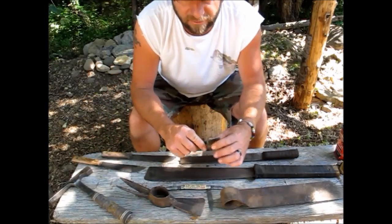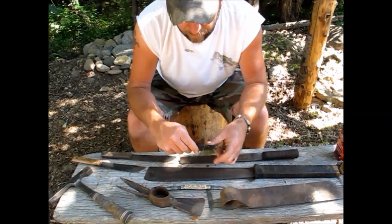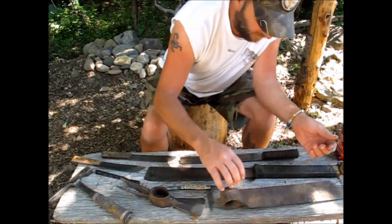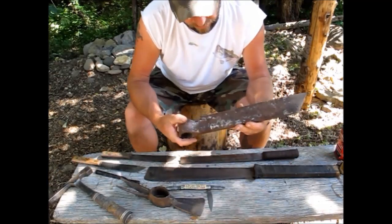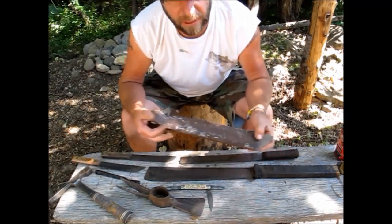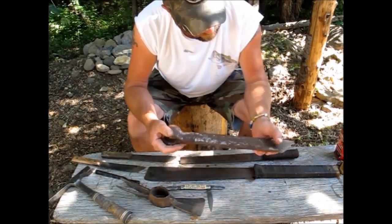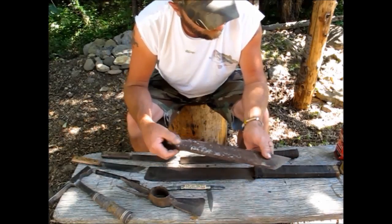So you use brass because it's a softer metal, and I have a bench grinder with a lighter brass wheel on it that I'll start off with. I just cleaned all these up, but this one I haven't even touched, and look at all the buildup on it. I can see there's actually some pitting in here. This is actually a shingle splitter. I'm going to rehandle it with a new handle and use it myself.